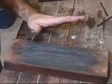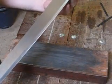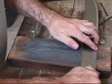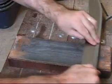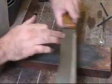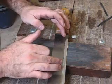Now the final step is to strop. This edge is already sharp with the hard Arkansas stone. This is a wooden block which I've covered with a piece of thick leather covered with white buffing compound. You take your blade, lay that Scandi edge exactly flat on there and draw backwards. That final polish will not hold up in the bush on the edge — it leaves a razor-sharp base of the blade, sharp enough to shave with. Now that edge will not take any impacts; if you smack into hard stuff with that, you're going to damage that portion of the blade.